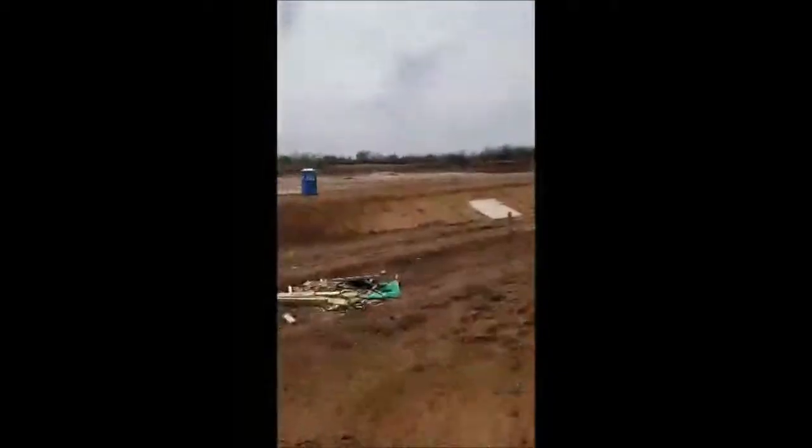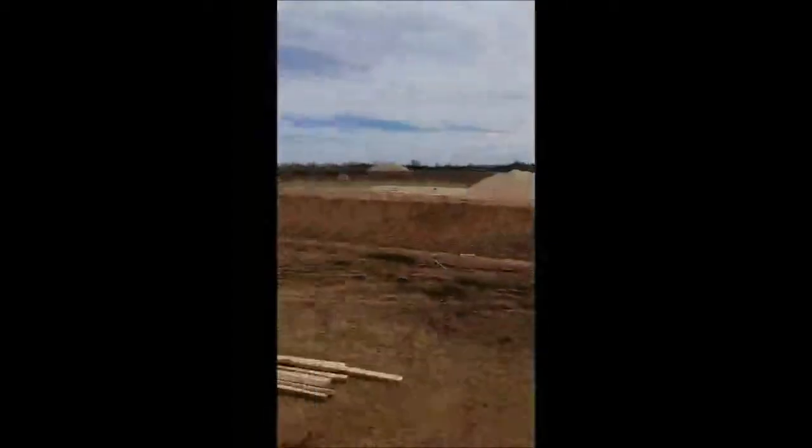Here we have the back porch, looking out. They're going to set some concrete stairs right here, which is nice instead of wood — love that. There's a heritage oak over there in Cibolo. Here we've got cement fiberboard, hardy board. I'm not a big fan of it, quite honestly. It's good material, but I prefer smart siding. It doesn't crack as easily when you're nailing it, it's lighter, you can get it in longer sheets so you have fewer seams and fewer butt joints.